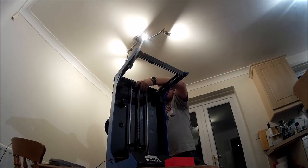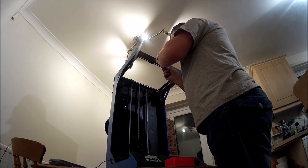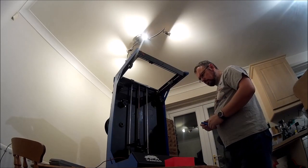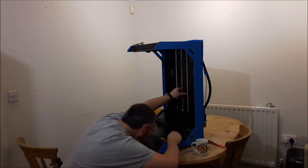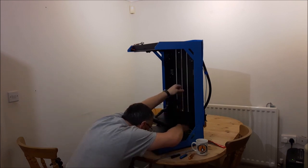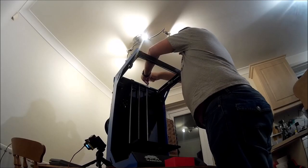Going back to how to get that XY table out — you need the lead screws and the rails out because they run through the centre of the casting. I'll just wind the bed up slightly by hand; try not to do it too fast because you generate current — that's what the display is picking up. Then get in there with the Allen driver and loosen off the top part of the coupling that's onto the lead screw.